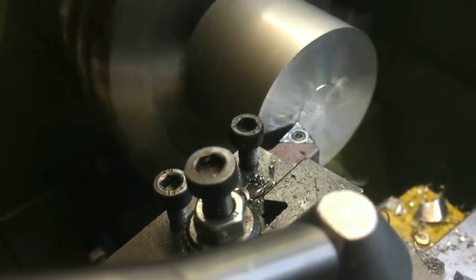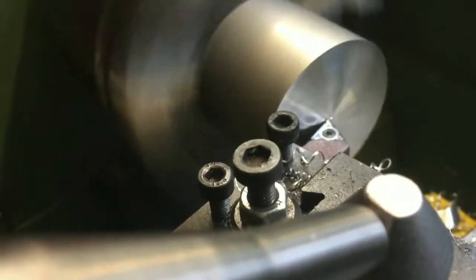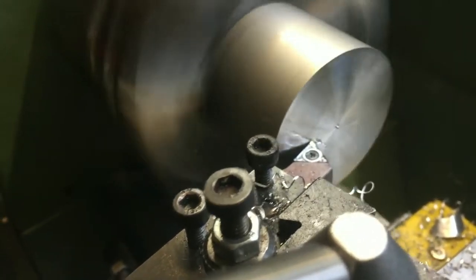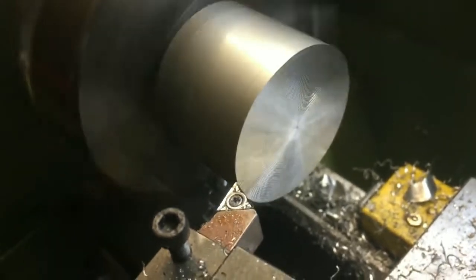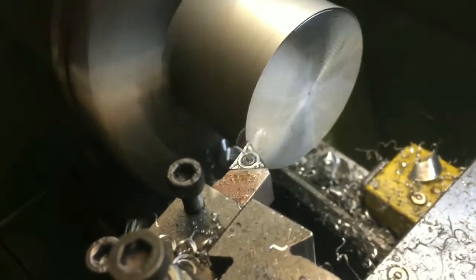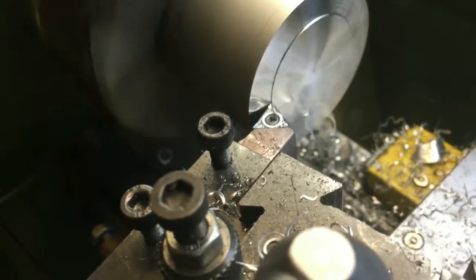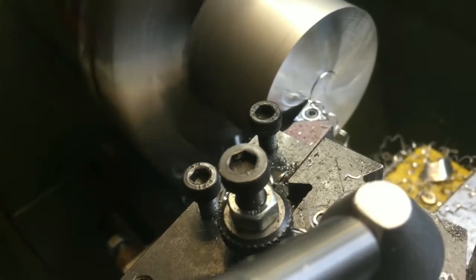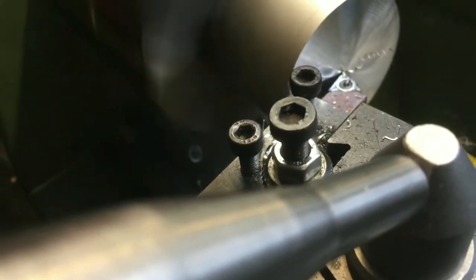Love working with aluminium. Got aluminium tips in my tip tool, but as you can see my lathe tool is a bit high — can't get to the middle. Let's sort that out first. Right, I've re-centred the tool. It's a question of the repeatability with this quick-change tool post, and as you all probably know by now I'm working on building a replacement, which once settled to one centre should stay on centre.